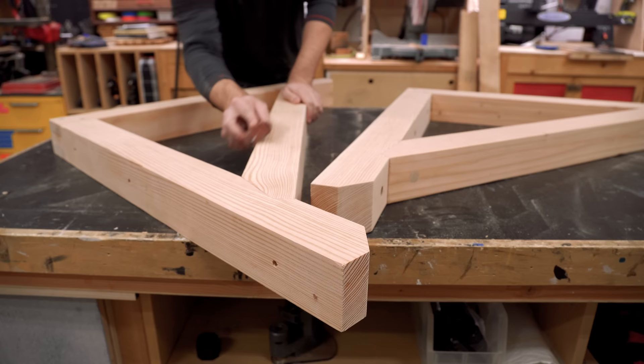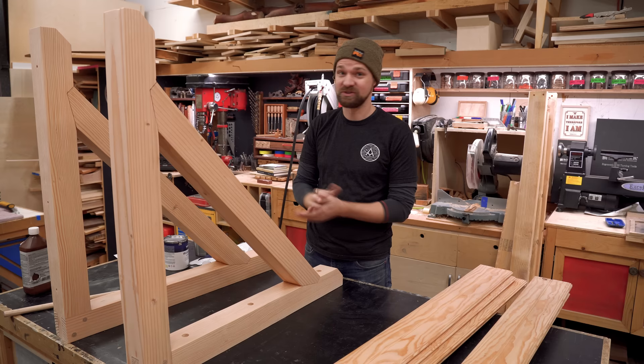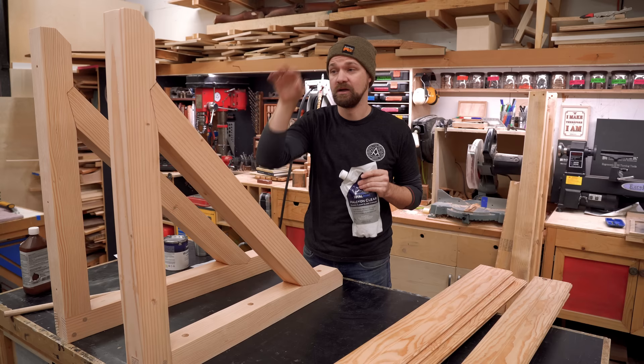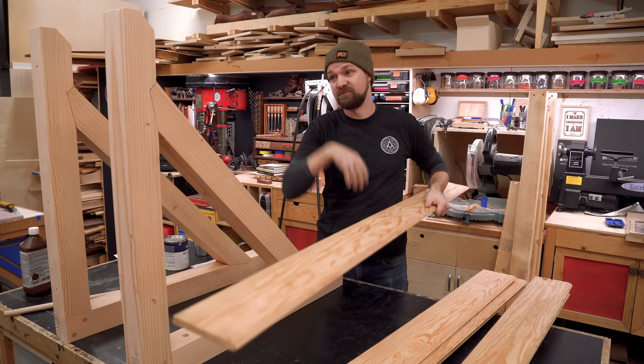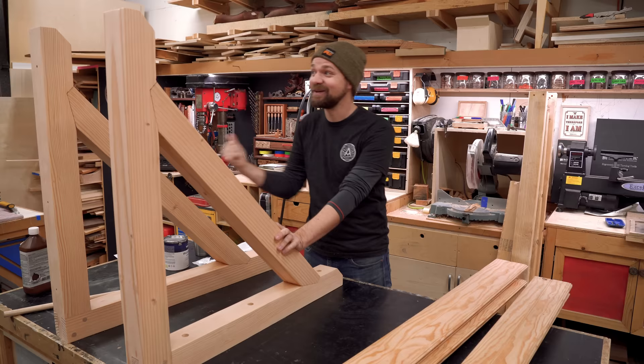These brackets were still pretty sharp from the milling so I went over with some 120 grit sandpaper and broke all the edges. I'll admit that I was planning on painting these, but the more I've been working on them the more I like them - the Douglas fir just looks so good. So I'm actually going to apply a water-based varnish; this is Halcyon Clear. I've got a full video on how to use this stuff - it's great, it's got a one hour dry time so I can get the at least six coats I need done inside of a day.